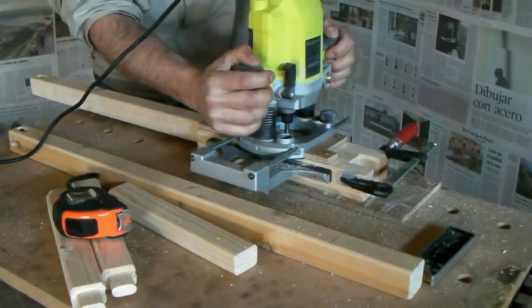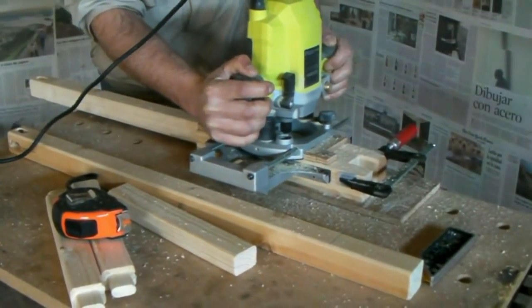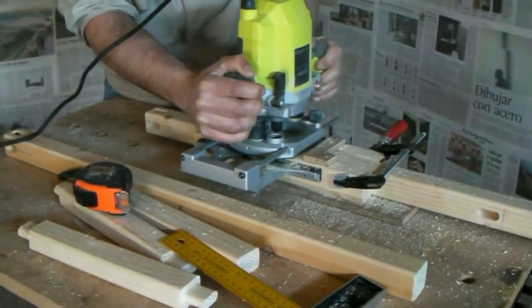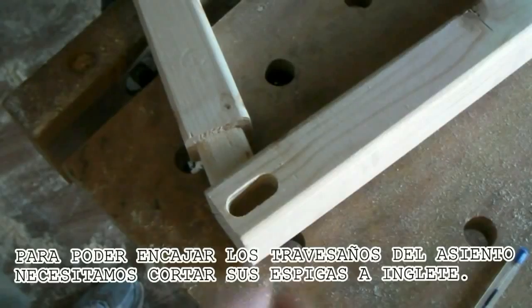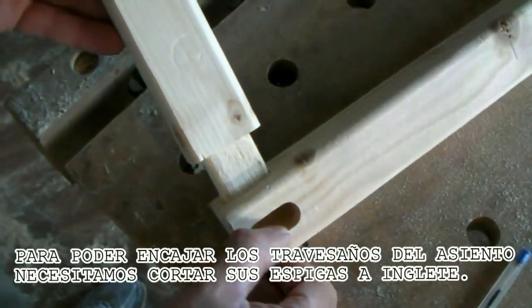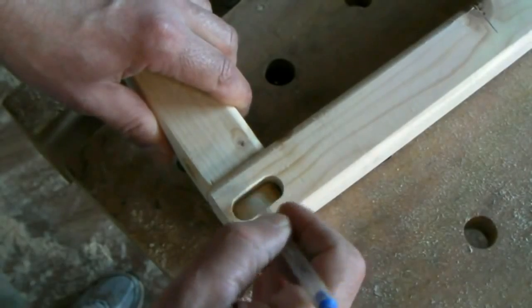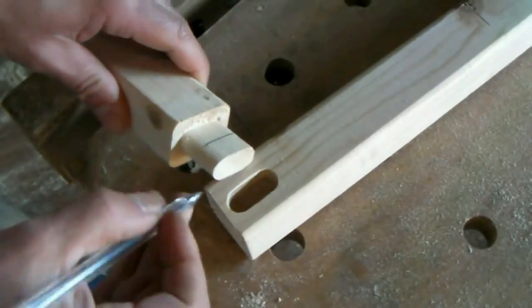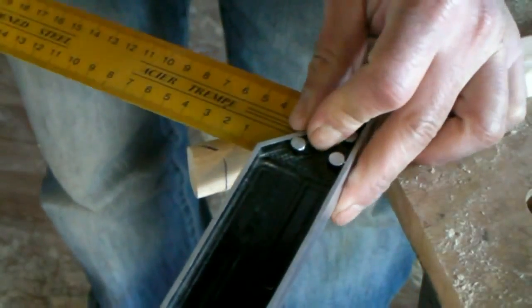You can find in my channel how to make the mortise and tenon jigs. I must miter cut the tenons to assemble the crossbeams that support the seat. I mark the miter cuts I need, and I cut them.